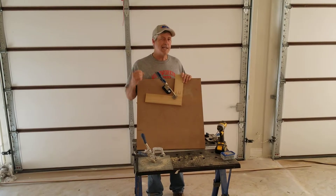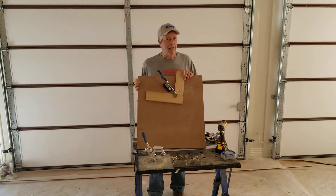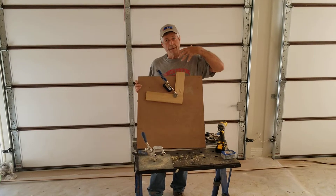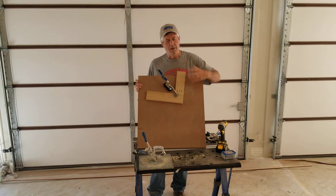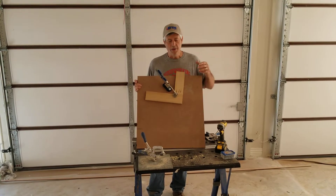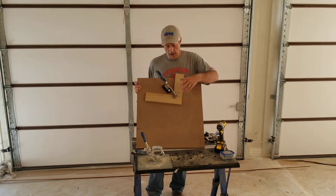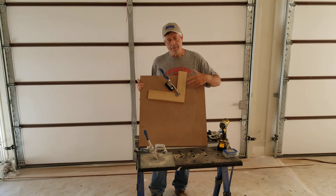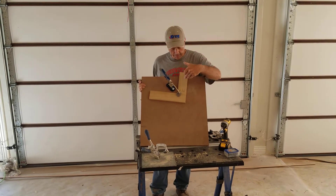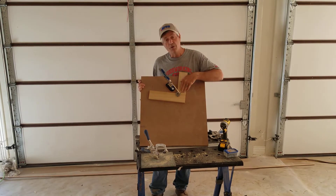One of the things I've learned — the secret of getting a great joint is to clamp it right. I've seen lots of people trying to use clamps to pull the joint together, clamping with a piece of wood in between to a table. But what you want to do is just let the screws do the work and pull the joint together, and don't have anything around the joint other than the clamp. The principle is the clamp is going to push the material down against a hard surface, and then the screws do the pulling.